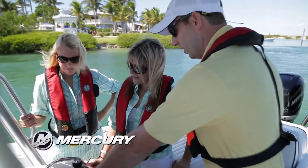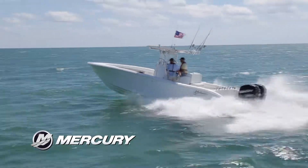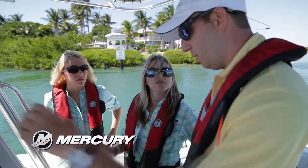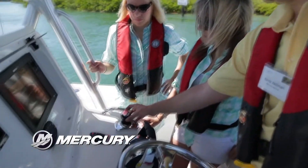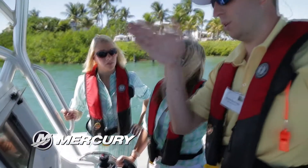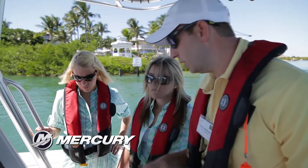We also have an integrated autopilot. You can press this button here, which turns on the auto heading. So say you're driving onto open water, you can hit that and your boat is just going to keep going that direction — whatever direction you're heading when you press the auto heading button. You can tap this joystick left or right for one degree turns, or the turn buttons here for ten degrees. So if you're going that direction and you need to start heading right, you can make those adjustments and then it keeps going.